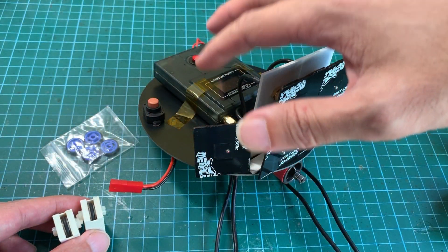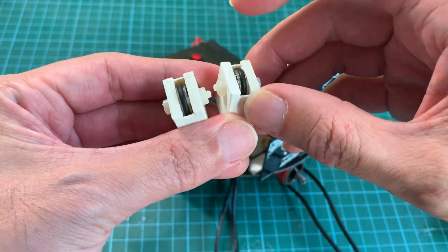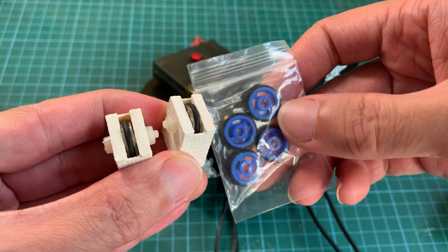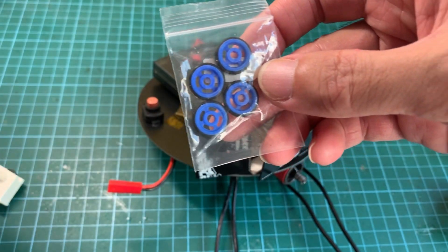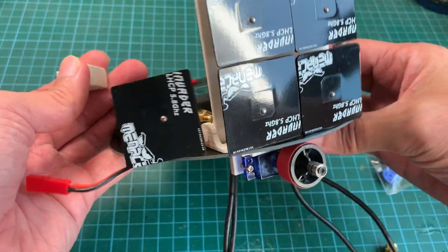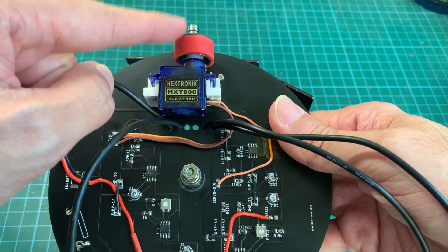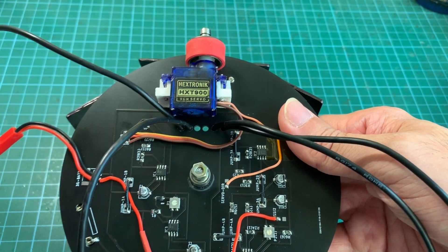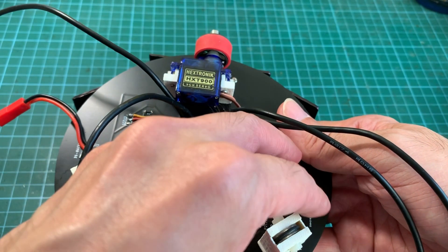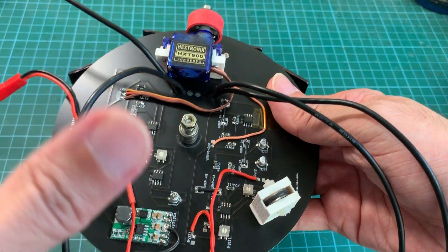The turntable is almost done except for the wheels. There are some 3D printed parts with rollers in them to act as wheels for the turntable — these rollers are the plastic ones with rubber trimming used in Tamiya Mini 4WD cars. The wheels will be installed to the base of the turntable. We already have the driver wheel, and now we only need to mount the 2 free-rolling wheels. We're going to use double-sided 3M tape to secure them in place, which should balance the turntable.